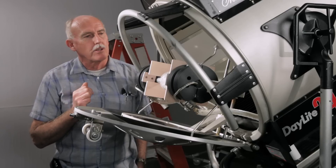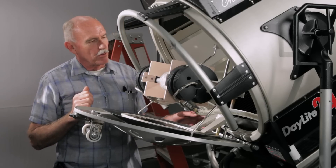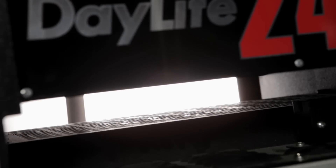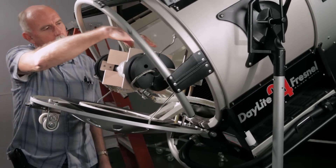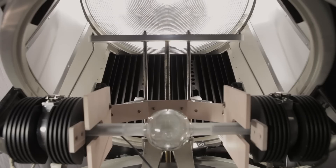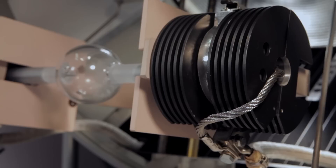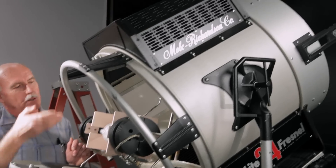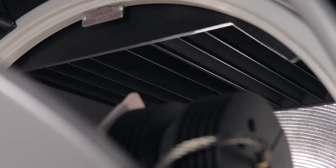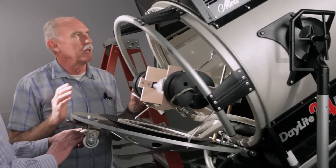Ventilation. This unit was designed so that the trough is separated from the main body of the light, allowing air to come in from the sides and go up into the head chamber. The louvers inside are angled to maximize airflow hitting the sockets, while also preventing leak light from coming out the bottom. The top is designed the same way — maximum airflow through the top, but angled so no leak light escapes. Virtually, when the door is closed, the only light you see comes out the Fresnel lens.